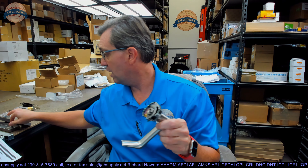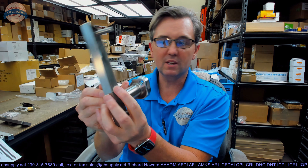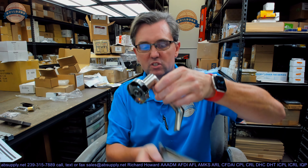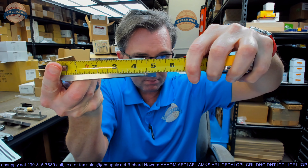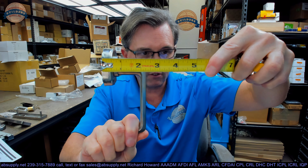The lever just sneaks inside of there and goes together like that. The escutcheon plates will go over the levers. A couple of dimensional properties: overall width of the lever is about 5 inches. It's going to have a total projection from the face of the door right at about 2 and a quarter, with a clearance of about 1 and 7/8 inches. It's going to be returning back to the face of the door within a half inch, which is typical for handicap compliance.